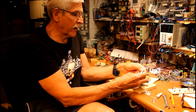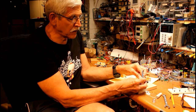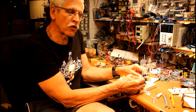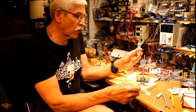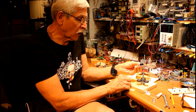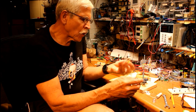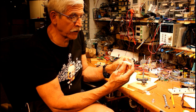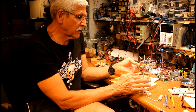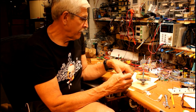Conveniently, that arm fits over that same 5/16" bolt, and you want to adjust it so that it just misses the magnets so they can spin by. The other thing you need in order to have a brushless motor is some way to turn the electromagnet on and off at just the right point — to pull these magnets along and then release the magnetic field when they go by. So what we need is an electromagnet, a base, a stand, some magnets, the fidget spinner, and some sort of switch to turn it on and off at just the right point.